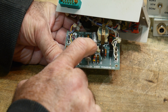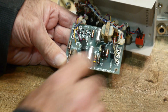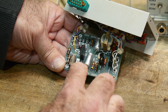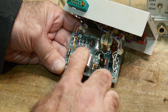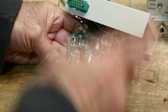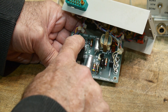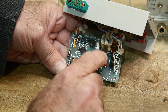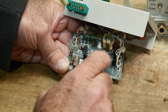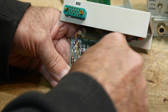There's a socket here on Q1. It's a 1500 series plus — there's the part number. There's a transformer; it looks like an audio transformer. And some kind of side tone thing here, so maybe this is an oscillator to inject some type of side tone for recording or something. Sometimes they put markers on old tracks. There's a little bridge rectifier, a couple capacitors, some really nice weird capacitors, and a nice big lump mica.